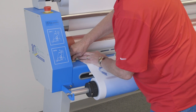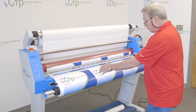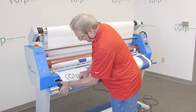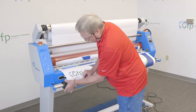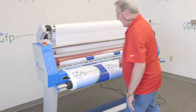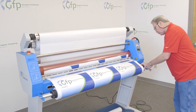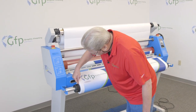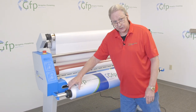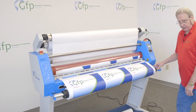Then I'm going to start the web through with my foot pedal. As I do this, I'm going to watch what's going on here and up on top. If I have to add any brake, I'll take these two knobs — one on both sides — and start adding a little bit of brake tension, using the least amount I can get away with. You want to make sure that the white brake pads are against the cardboard tube, not against the media. If it goes against the media, it's not going to work properly — it has to go against the cardboard tube.